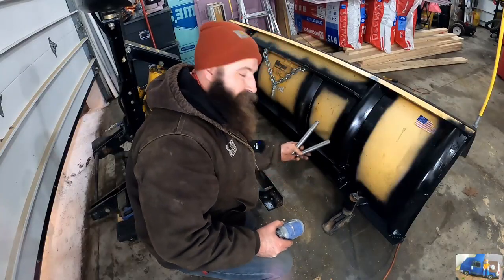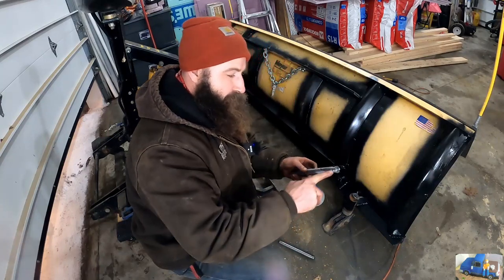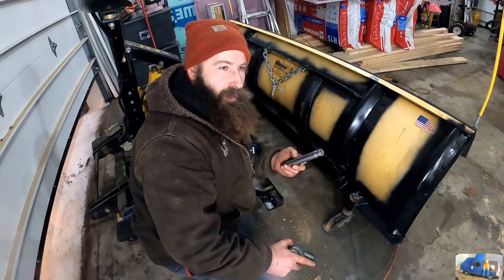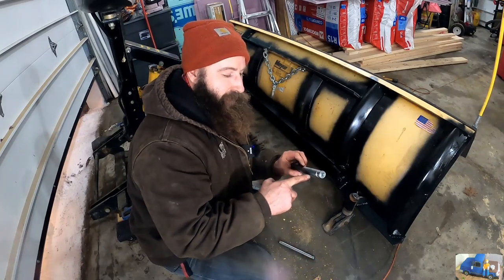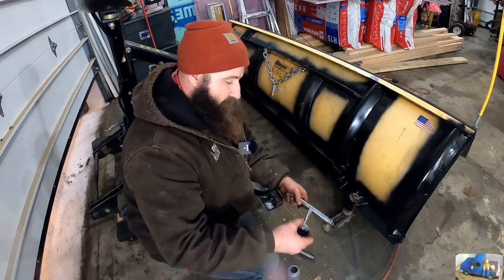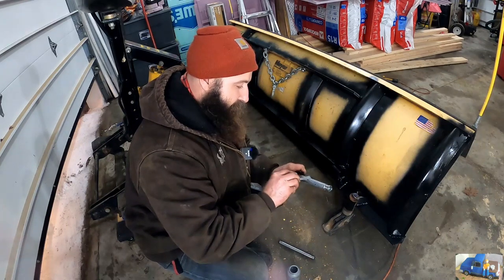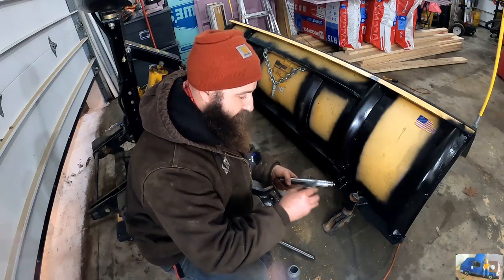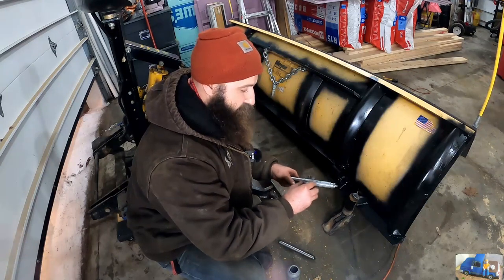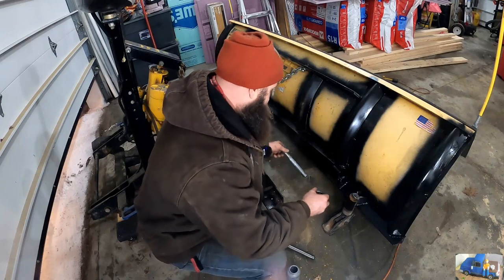Don't forget to put your pins into the mold board before you wheel in your bracketry. Now I hooked up the grease gun, double checked to make sure my ports would feed grease and also pump out anything that was bad in there. As much as I don't want to, I'm gonna go ahead and smear this up with the old silver stuff. I really don't want these getting stuck in there again. Supposedly this will keep it from getting stuck. I don't know. Nothing else will get me all nice and gooey.